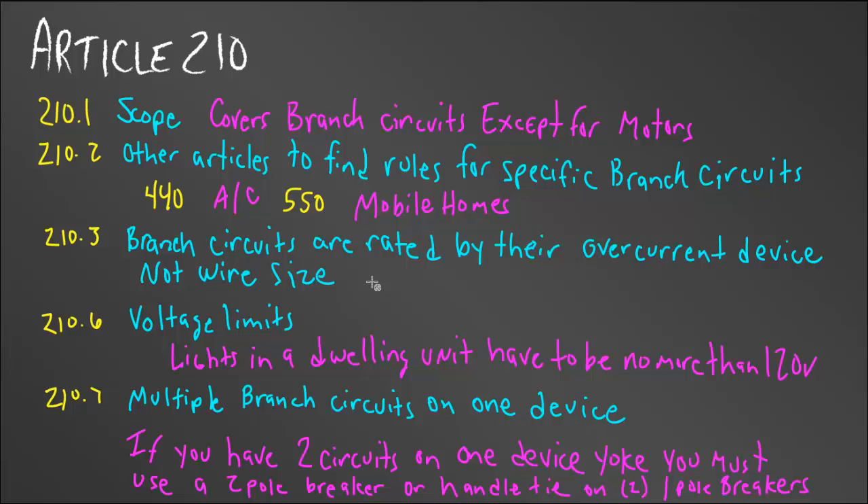We talked about a website where a guy finished his basement and put in a 125-amp subpanel, wishing he'd had a 200-amp subpanel installed. But he said it's connected to a two-pole 60-amp breaker in his main panel. So does he really have a 125-amp subpanel? No — because the circuit that supplies it is only 60 amps. Keep that in mind when you see different-sized conductors connected to smaller breakers — it's usually due to voltage drop or limiting power to equipment.